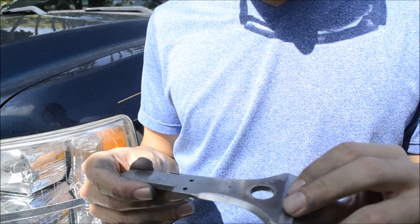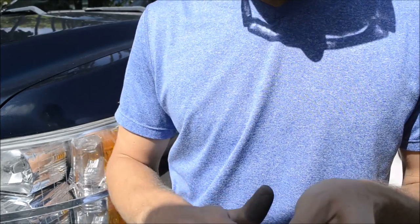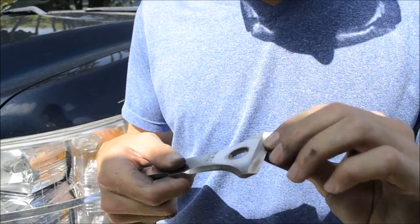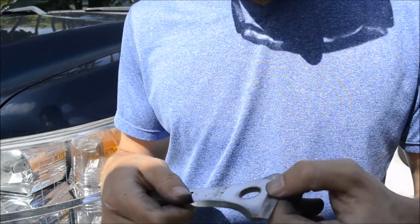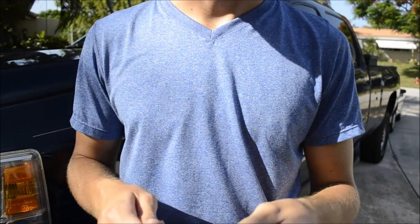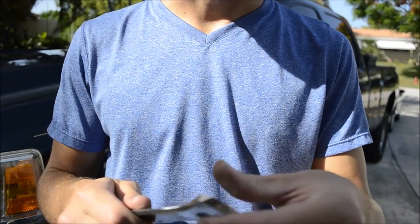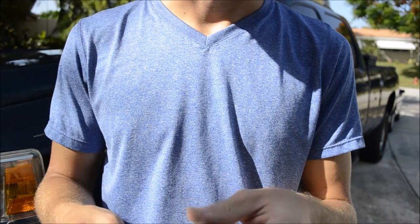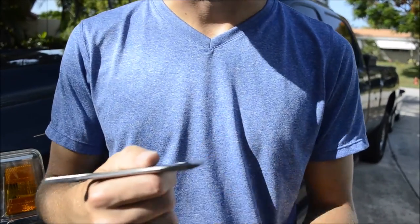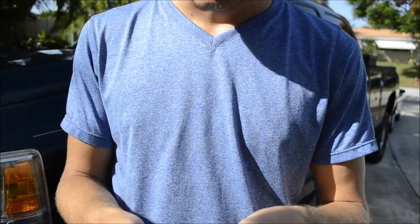Here it is all polished up. I used a belt sander with 120 grit on the sides to take all the crud off, then worked my way up with sandpaper by hand. It came out pretty shiny. Now I'm going to put the edge on this part of the blade — start with a file and then use a whetstone to get it nice and sharp. I didn't put too much of an edge on it because if I'm chopping wood or anything harder than paper, a really sharp edge would probably chip off. So I left it sharp but not razor sharp so it lasts longer.